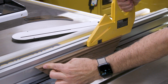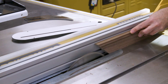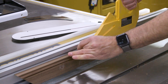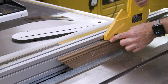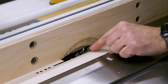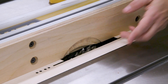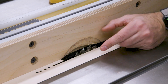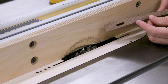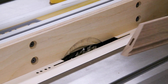Normally you'll never see me reach around to the back of the blade — it's just not safe — but sometimes in woodworking we have to take calculated risks to get the job done. Next up, we need to cut the double rabbet. I've got a dado stack installed in the table saw and a sacrificial fence that allows me to bury some of the blade into the fence so we can cut right up to the edge of the work piece. It's a two-stage cut: the first is for the backer material thickness — about an eighth of an inch for hardboard — and then we'll move the fence so we're only cutting the last quarter inch for the glass.